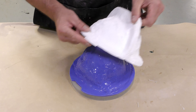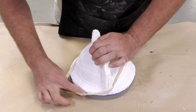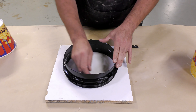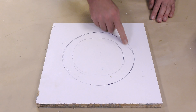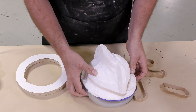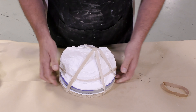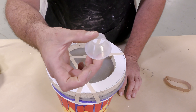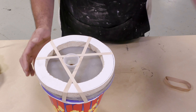Align the two halves of the mold, then put the entire mold together with the support shell — the alignment key is very helpful here. Strap the mold together using rubber bands, both around the support shell and creating a compression ring to hold the two mold halves together. A circle is cut and the center removed, creating a second support half for the bottom of the mold to prevent it from floating apart. A small container is used as a pour spout on the mold.